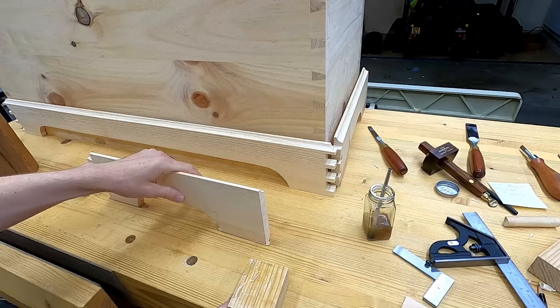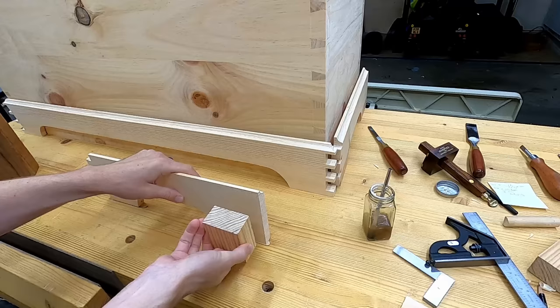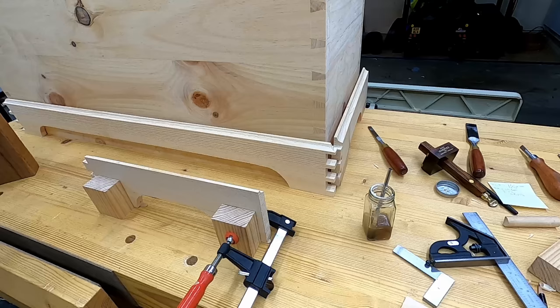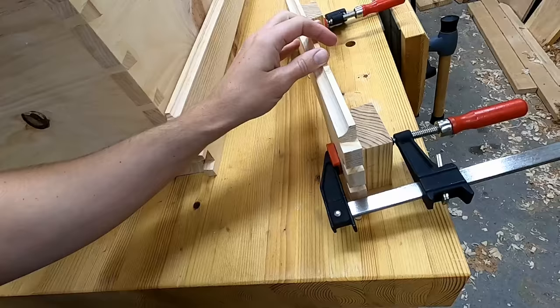As I paint the glue on these glue blocks, I'm trying to avoid putting glue right on that lower edge that's not going to be sticking on anything — but it probably doesn't really matter that much. When I drop the blocks in place, I could just squeeze them in place for a bit or put something heavy on top, but I figured I'd just hold it in place with a clamp to make sure it doesn't move. And that's that — check it out from this angle. You can see that gives it a nice little offset. It's going to protect the trim board; it won't be bumping into anything on the ground, scooting around, or breaking off.